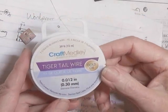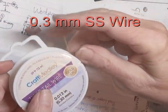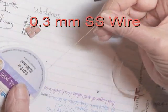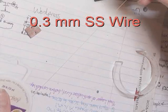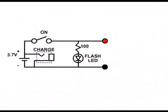Then I noticed I have some thin stainless beading wire and checked out what might be the resistance of a meter so it could be used as a heating element. The actual resistance wasn't exactly as in the charts so I suspect it's a less pure stainless than 316.